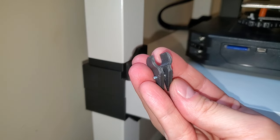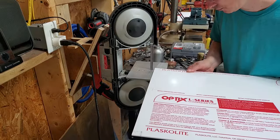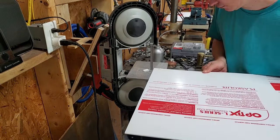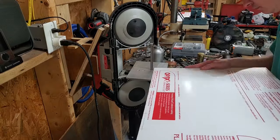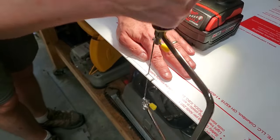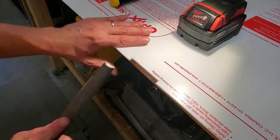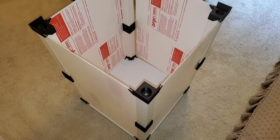Removing and replacing the top is as simple as this — the other part of the hinge snaps onto the cylinder. Now I just need some plexiglass. I purchased a 4x8 sheet, 3mm thick, locally for $88 plus tax. All cuts were free and I kept the leftovers. I only needed four panels but had five cut just in case. I carefully marked out all the cuts and did the easy ones on the bandsaw — a hacksaw would also work great for straight cuts. For the center cuts, I did three passes on one end to fit the coping saw blade. The blade made clean cuts, but finer teeth would have been easier. I cleaned up all the cuts with a file. I only needed to remove one connector to fit in all the acrylic. I marked all mounting holes with a Sharpie and drilled the plexiglass just a hair larger with a 1/8-inch bit.